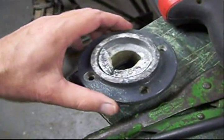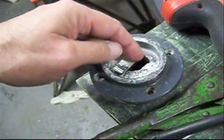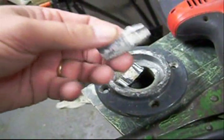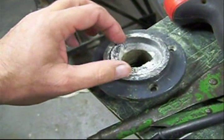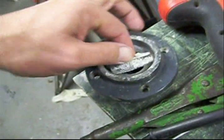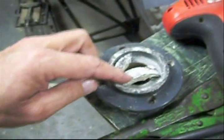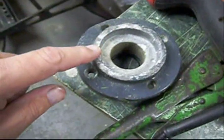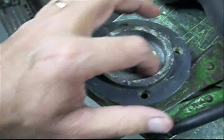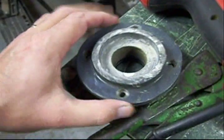Here's the zinc pieces after it was cut out. There's a lot of solid metal here. The problem is that this inner edge grows out towards the shaft, and that was hitting the shaft. You can see the scale on it — it had to be cut out in about four little separate sections and then knocked away from the wall. So there was definitely very little contact here for protection. The zinc definitely needed replacing. The water had seeped down in the side where the zinc had been pressed in. Not really much damage to the actual housing from corrosion though — that's pretty good. A couple little nicks from where the drill and cutter went; we'll fill those back in and probably press another zinc right down into the hole.